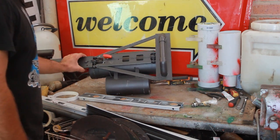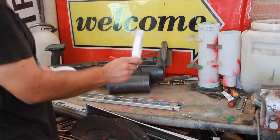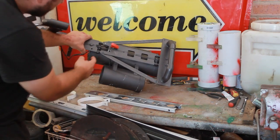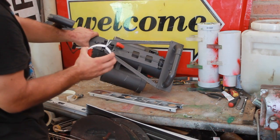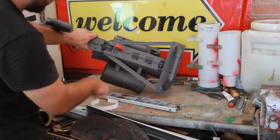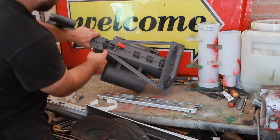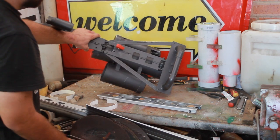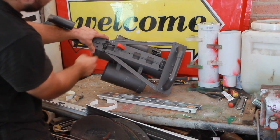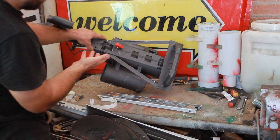The only big thing is I'll be using these bolts. What basically happens is this goes around the main pipe. I've got to drill bigger holes here to accommodate these bolts. And then what you do is, to squish this together and give it a tight grip on the pipe, I've got the bolt through this piece, through this. I had to drill a hole and then actually cut away the aluminium so that I can get a wrench in there. And then basically you've got the bolt, a nylon nut, and then two nuts in the middle, which when you tighten them together, they close this over the pipe. And that's basically how it's done.